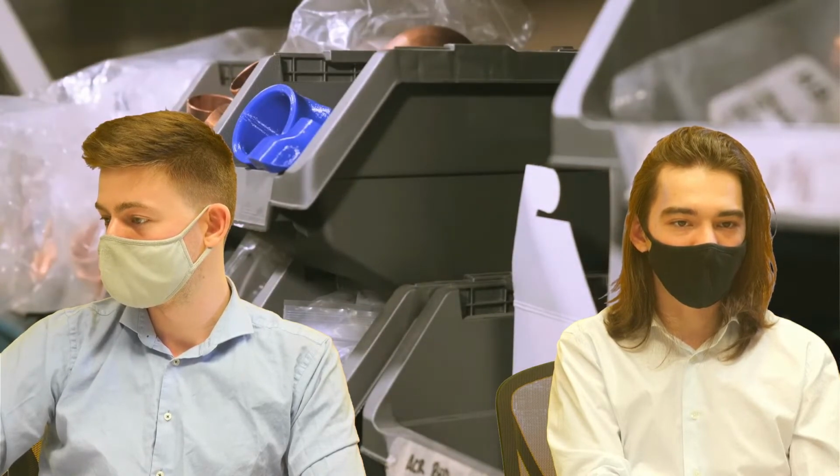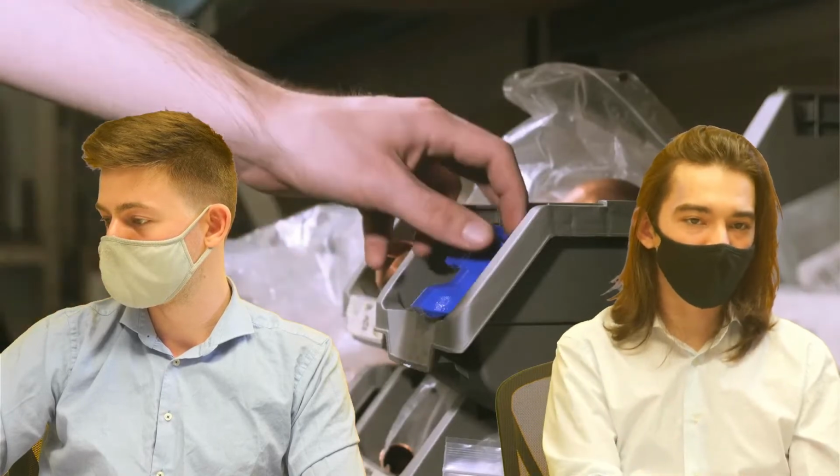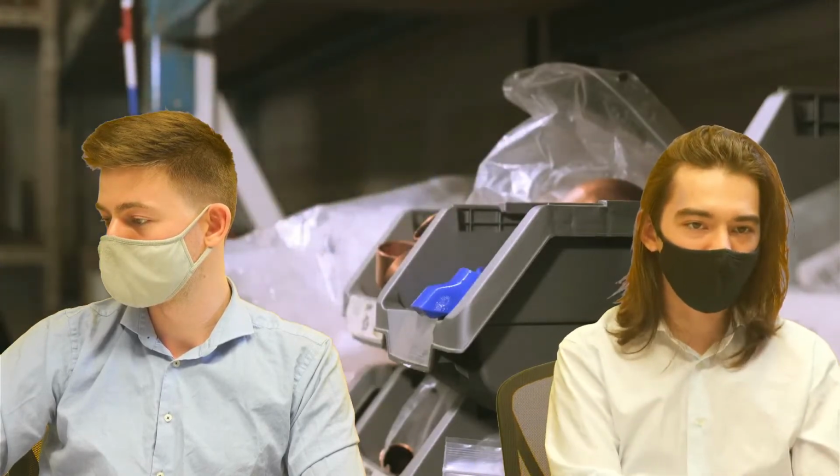Several magnetic plates that I swap between when printing. Be careful, because you're moving parts in your printer, to watch that Z offset. Different thickness plates could cause bad issues. Cool stuff. Cool down time equals downtime. It is downtime, but there are ways of optimizing it.